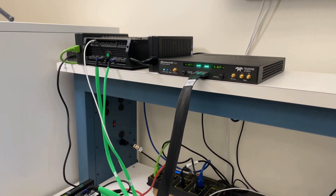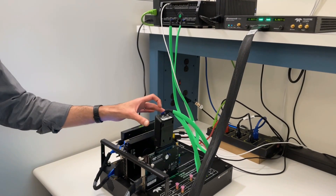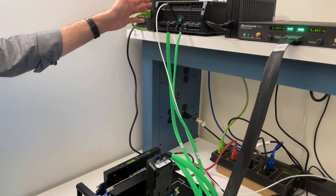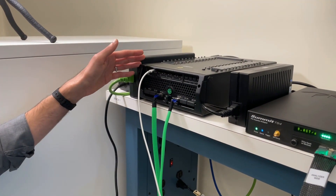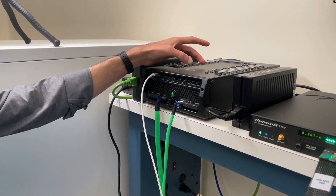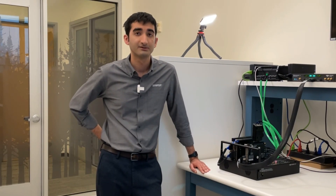The third item plugged into the platform is our device. Looking through this interposer card and adapter card on the other end of the tables, we see that it's plugged into a Synopsys HAPS 100 unit. This is our prototyping platform — it has a single FPGA with our DesignWare CXL 2.0 endpoint controller IP. Importantly, Teledyne LeCroy is not using a Synopsys IP within the Z516 exerciser equipment, so this setup actually has two independent implementations of the CXL 2.0 specification. This is a key point for interoperability.